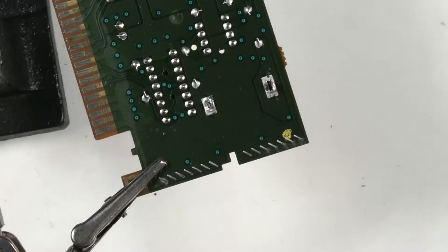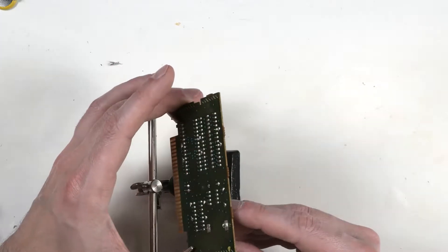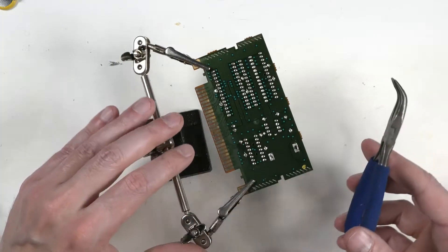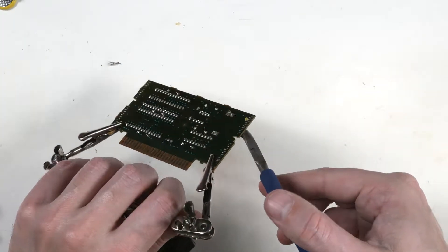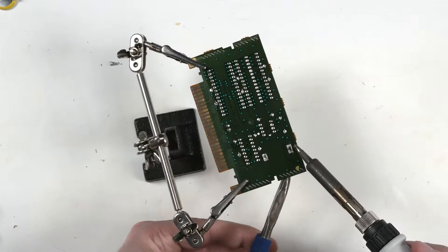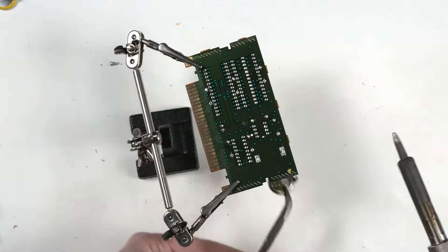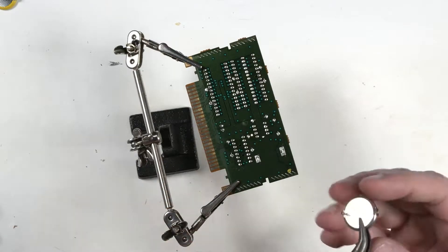Do the same thing to the negative side. We are going to have to grab our pliers. What we're doing is gently grabbing the battery — we're not cranking on it, not prying with it. We're heating up the solder on the board and just gently pulling. And there you go — the whole battery came out. Didn't need to do anything extra to the negative side.